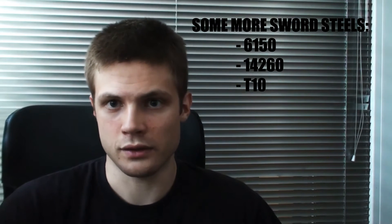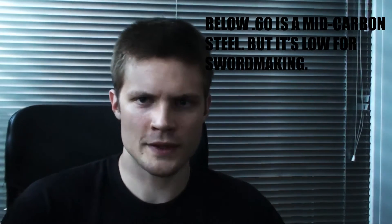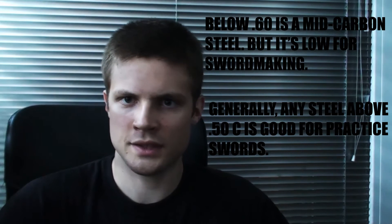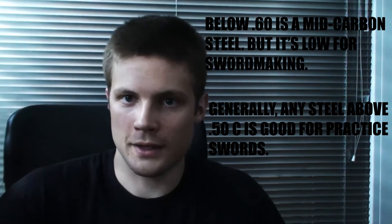However, it is always carbon steel that is used for swords. This isn't the most important thing with making swords, though. You can have the best steel available but still have a bad sword because it's heat-treated badly. You can't really say how well a blade is heat-treated until it breaks — or if it doesn't break for a long time, then you know it's heat-treated quite well, or it doesn't take a set. Lower carbon steels are more likely to take a set, so to lose plasticity. But if it's a very low carbon steel, below 0.60, you might actually bend it back without worrying about plasticity affecting the breakage. I think Darkwood probably uses steel with a carbon rating below 0.60, which is why you can play with a point and it bends back and forth a lot and doesn't break, surprisingly.